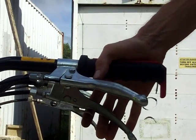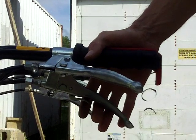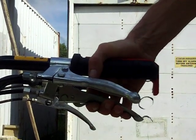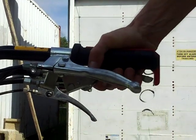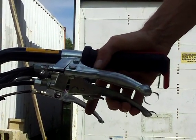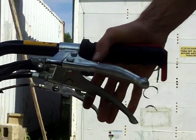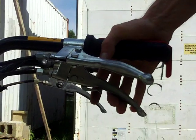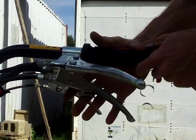If you're squeezing the clutch quickly to just shift gears or engage the PTO, you simply engage the whole handle — that is, you pull the trigger at the same time, and as long as the trigger is depressed, it's not going to lock itself. It's only when you relax your finger off the trigger that it does lock. So that's nice because it's kind of a one-handed deal — you don't have to swing the other hand over like you do on the BCS.